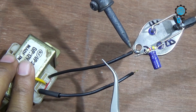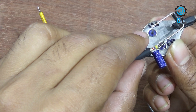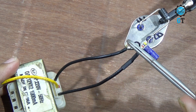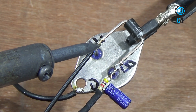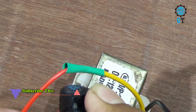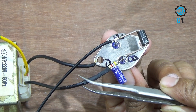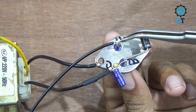First we connect the T3 cable with the collector of the transistor and the T1 cable with the capacitor positive leg. For safety we are using a separator so that there is no short circuit. You can see that T2 cable is not connected. The T1 cable is connected with the capacitor positive leg and T3 cable is connected with the collector of the transistor. For power source we are using DC 12V — we connect the DC 12V negative cable with the emitter of the transistor and the DC 12V positive cable with the T2 cable of the transformer.